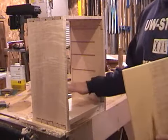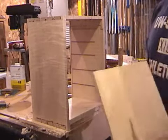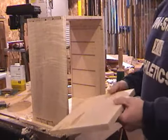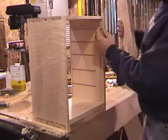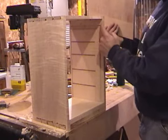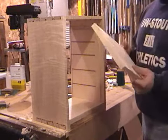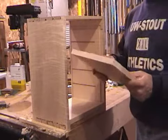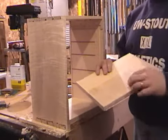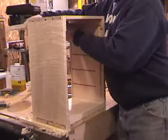So the bottom one, not much to do - just cut it to fit the width of the box and glue it in place. On the top one there's a little bit more work to do. We're going to slide this in and we have to notch this shelf right here so that our joint out here matches the joint here. Before you glue this in place, make sure you flip it over and cut the two dados that we need for the vertical drawer dividers.